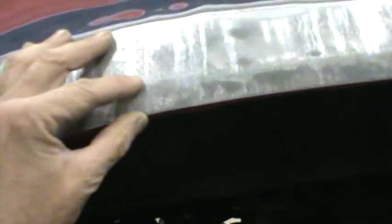There were a few bubbles in the paint and I was just certain those would be holes. You can see the spots here - I took my poker hammer and hit it sharply. It does have a dent in it right here from where I hit it, but it's not soft at all, it is very solid. I was thinking I was going to have to cut this out and put something in here, but I'm not. If it would have been soft and my hammer went through I would have replaced it, but it's not rusted over here on this side.